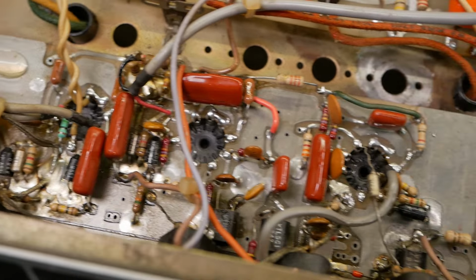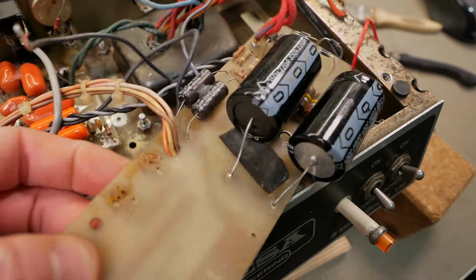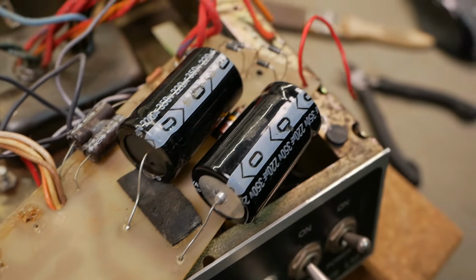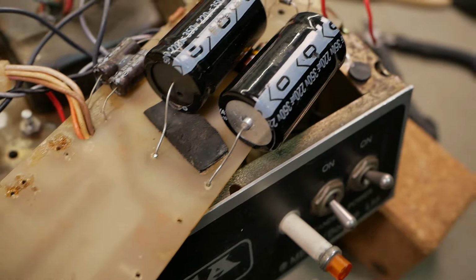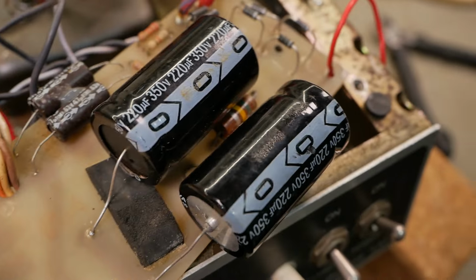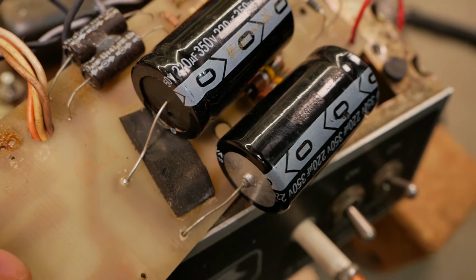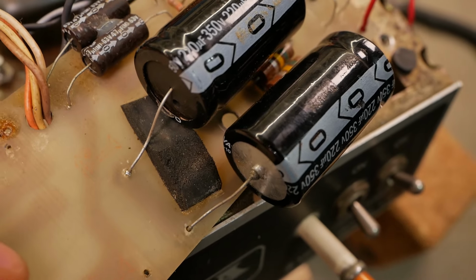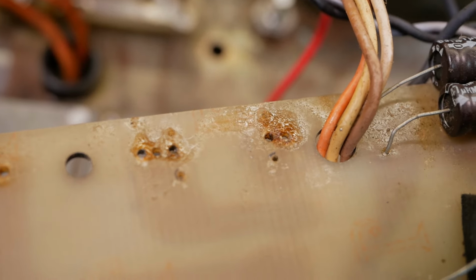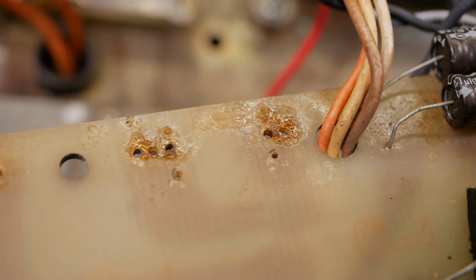And speaking of values, I was halfway through depopulating and just cleaning up the power supply board and securing the caps properly with silicone instead of this weird foam bits of tape left, right, and center. And I was going to mount the balance resistors on the bottom side so then we can silicone those two caps together after putting the screw in. It's a bit annoying that the screw's there, but there's not a lot we can do about that now. When I noticed that the four resistors, they were 22K each, coming to a total of 5.5K, and the schematic says 5.6.